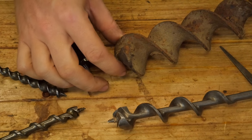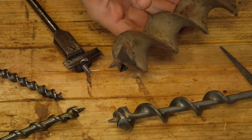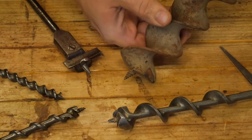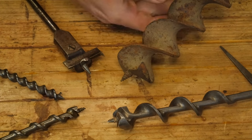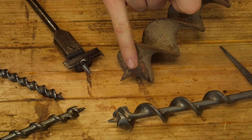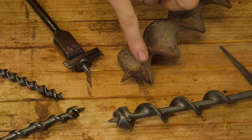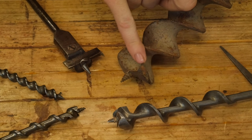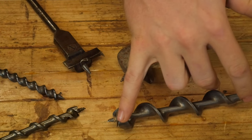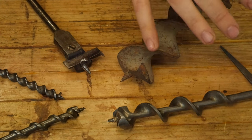On the bigger ones made for more of your post work — like this monstrous two-inch bit — it has a blade but it doesn't have a knicker out on the side, so the blade determines the size of the hole. There is sort of a knicker but it hangs down, so that's the last thing to touch the hole and it will kind of clean it out. This will leave a little more rough of a hole than having the knicker touching first, but it works fairly well and is very fast and efficient.